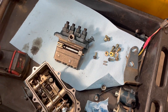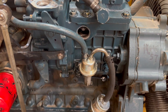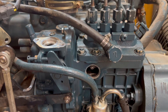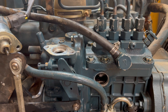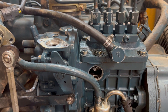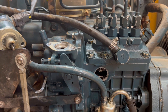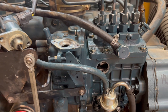Pretty sure those are all the problems. Good luck with this — they're very simple, but they do have these nuanced little tricks that you're not going to find in any manual. PowerSource gave me a really good suggestion, and a place called Country Store that rebuilds hydraulic and injector pumps clued me in that it's only supposed to be six inch-pounds on that nut. I'll post the links in the comments section. Thanks for watching.